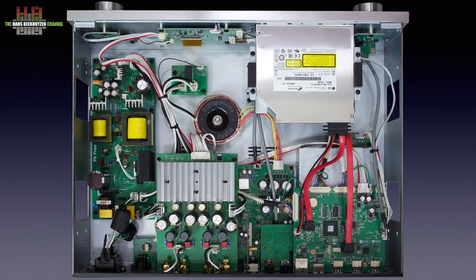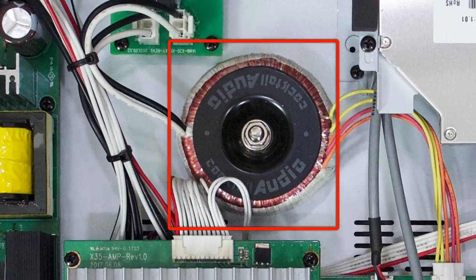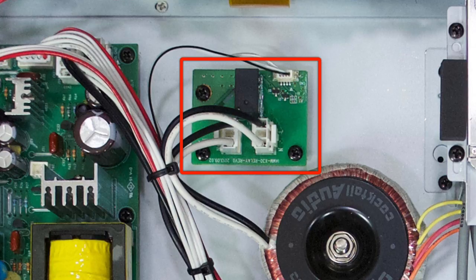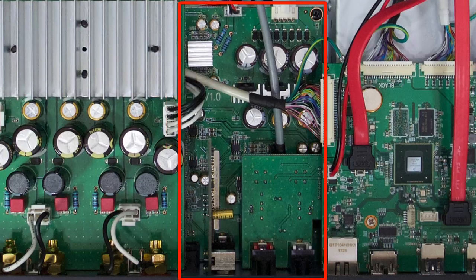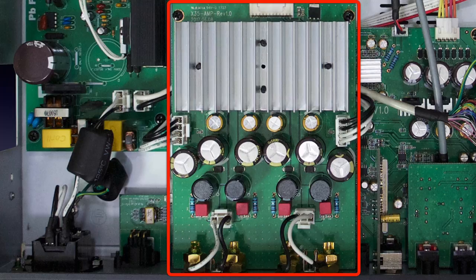For a device with this many functions there is quite some room free inside — not due to an economical design. On the left we see a double power supply for the processor board and drives. The audio is fed by a toroidal transformer while the rectifier stabilization and capacitance is situated on the audio board. A solenoid switches off the power to the audio board when appropriate. The audio board carries the phono input board and a small vertical board that holds the tuner. It also holds the ESS ES9018K2M Sabre DAC chip that can handle digital signals up to 32-bit 384 kHz. The power amp is a 2 x 100 watt into 8 ohms Class D amp, allegedly based on Texas Instruments components — I couldn't verify this without taking the unit further apart.